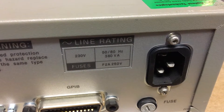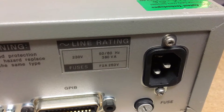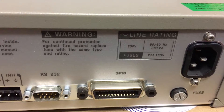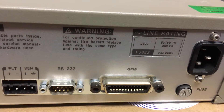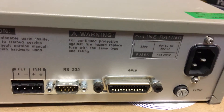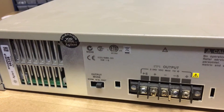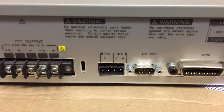Which is not what we use here in North America. I'm in Canada - this was bought from the States. They use 120 volt; here in Canada we use 120 volt. So my best guess is that in all likelihood this is a perfectly good power supply. The good thing about this is that the transformer inside is completely configurable - you just change a few jumpers and you can set it to 120 volts. So that's gonna be probably my second video: tearing this apart, taking a look, seeing if we can get it to power up.